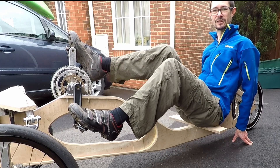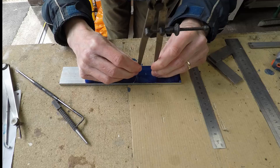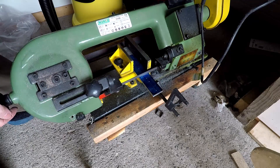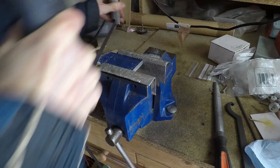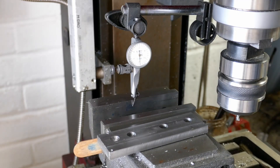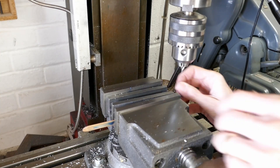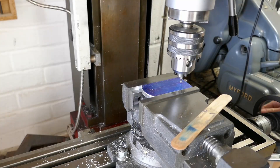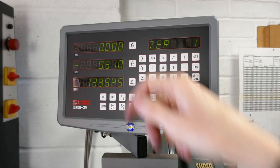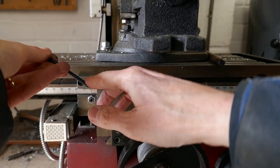Let's dive in and have a closer look at making some of the parts. The first job is to mark out the shape of the dropouts onto a piece of thick aluminium bar using marking blue and scribes. Here I'm cutting off one of the dropouts and sawing and filing it to shape. I'm now setting up the vice and the milling machine table, setting the vice jaws square using a dial test indicator, and a couple of parallels on which to mount the dropouts. Setting the table stops accurately using the digital readout for guidance, so that I can drill the positions of the bolt holes accurately in the dropouts.